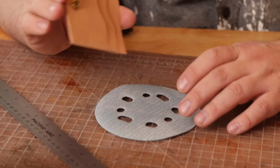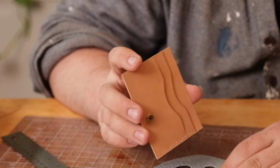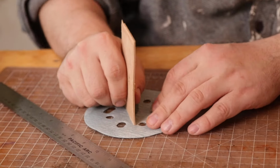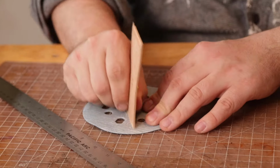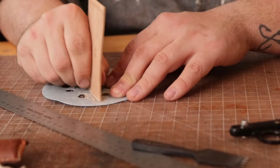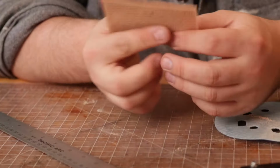So before we burnish, I'm gonna sand down. I don't have any 200 grit, just flat sandpaper, so I just grabbed a sanding disc, but it's just a flat space, so it's easiest. We have a sanding drum, but I find it easiest to level everything by just putting this flat on our board and just kind of sanding it down like this until it's good and ready. Again, this is 200 grit. Then what I'll do is I'll go in and bevel my edges and sand with 400 grit. And then you're good.